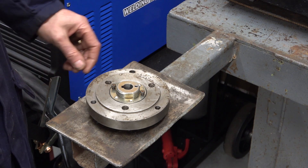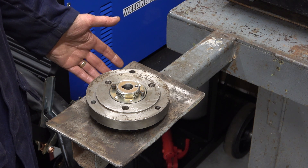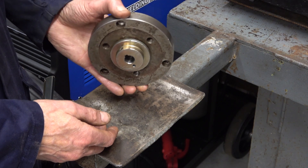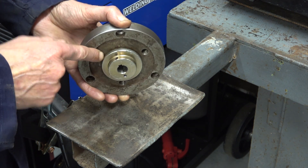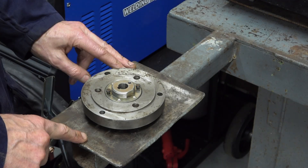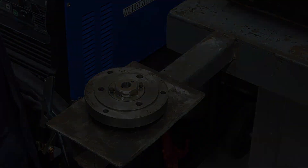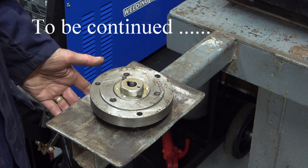It's still today actually. As I stood here looking at this I've realized something - which you've probably realized already and I've only just figured out. The spring is acting in the wrong direction. I want the spring to cause pressure between this face and the copper sheet behind, but with the spring behind there it's acting in the opposite direction. So I'm going to have to sleep on that one. Can't believe I've got to this point before I realized that. Never mind - if you were at home going 'but the spring's on the wrong side,' you were right.